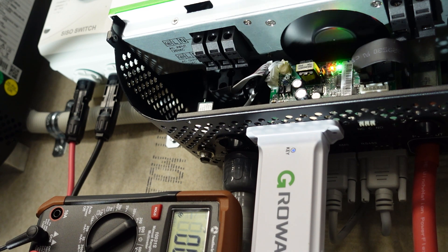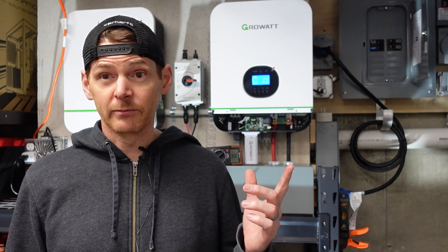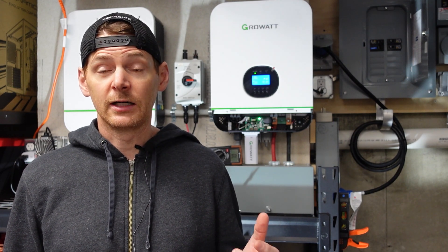Now you can imagine — well, we saw what happens when you plug it in. It's a short, you get a ground fault. I'm trying to figure out why this is the case. It only happens when the inverter is powered on. During the startup phase, before the output kicks in, the bond is not there — so it's only once the output kicks in. All three terminals on both units, because I tested both of them individually, are bonded together. Obviously that's a problem because as soon as you try to plug something in, you create a short and it just trips my ground fault breaker.